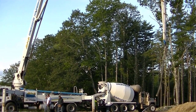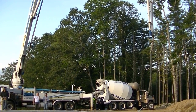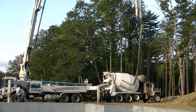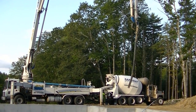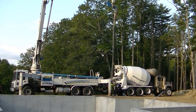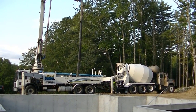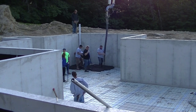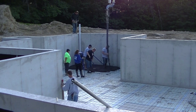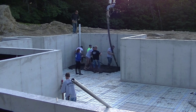This is a typical basement floor in Maine. We get a lot of frost — the frost goes down four feet into the ground, so most houses are built on a foundation like this. This is an eight-foot-tall foundation, so we're pouring the floor down inside the basement. The access wasn't very good; it wasn't really backfilled or anything, so that's why we're using a pump truck. We call this dangle pumping — the pump operator is just dangling that line and we're putting the concrete right where we need it.